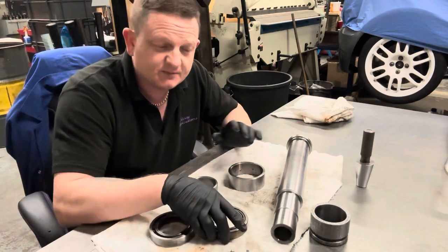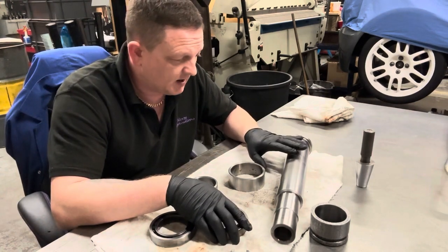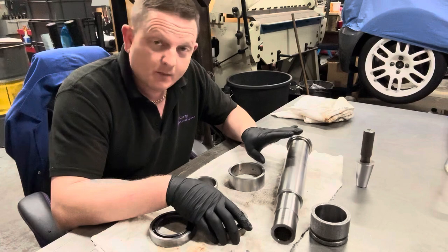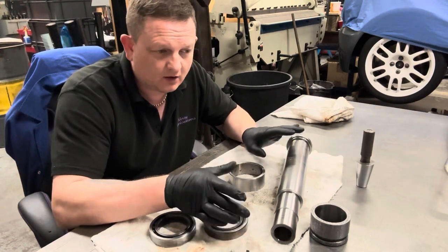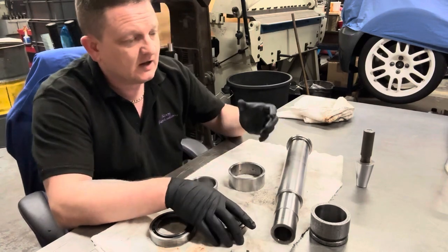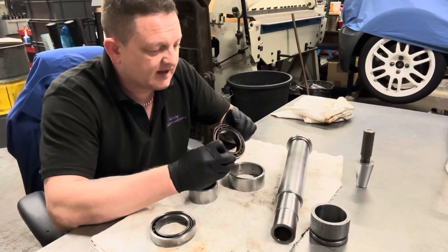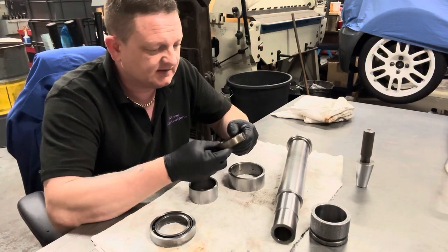And obviously this machine, I'm pretty sure for most of its life, or at least the last good amount of years, he'd done drilling and tapping on cast iron, and they were big drills and big taps. When I went and viewed the machine, they were using like 1 or 1.5 inch taps. So it's tapping slowly, but there's obviously a lot of force going up and down into the spindle, which has helped wear the bearings out. And then together with moisture in the air supply, I suppose that's it, the bearings are done.